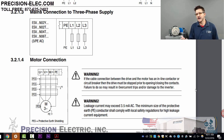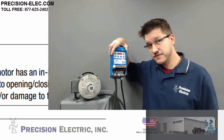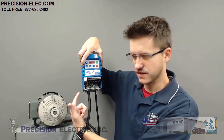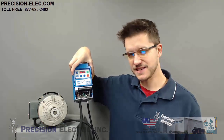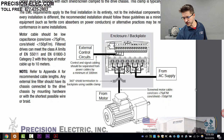That's pretty much it with your main supply. We're going to get down to the fusing chart in a bit. The motor connections are U, V, and W of your motor leads. Your motor should have three leads and a ground — so I've got U, V, and W. Notice the motor leads are on the left side of the drive, and my ground is in the middle, shared with my line-side ground. These drives are for three phase motors only — you cannot use a single phase motor on a variable frequency drive.